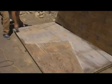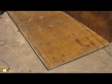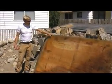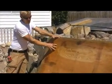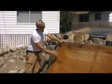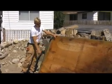Now you just stand it up. Okay, these have been pre-treated already. I've used diesel to pre-treat the concrete forms. What diesel does is puts a raw petroleum product on the face of the wood. You can use a proper release agent if you wish. They sell it. Diesel works pretty well. It locks up the surface grain of the wood, makes it somewhat waterproof, and repels concrete.